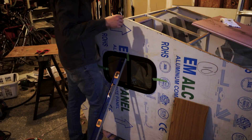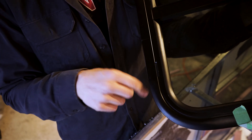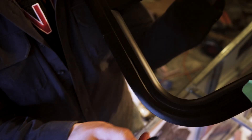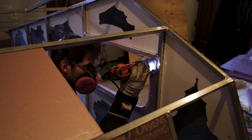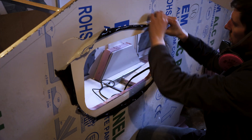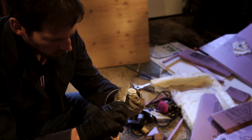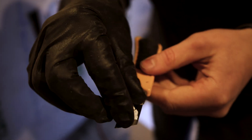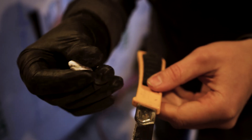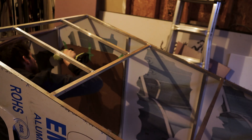Back to the window. Just getting things lined up. This side's gonna be down, so I'm removing these weephole plugs — that's what they're called. To create a flush surface for the trim ring, I had to rout out a channel about a half-inch wide, quarter-inch deep, with a flush-cut trim router — probably my favorite tool. For the existing screw holes on the ACM panel, I've decided on JB Weld Plastic Weld. You cut off a piece, roll it in your fingers until it's a uniform color — that activates the chemicals — then stick it in the hole. I'm putting it on from the inside out so there's less material on the outside. I don't want a big patch showing.